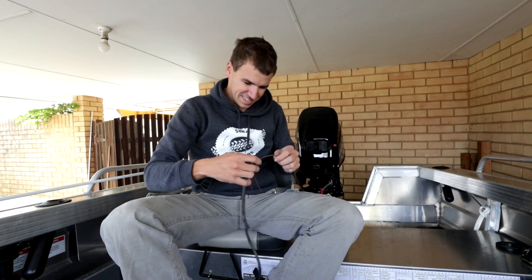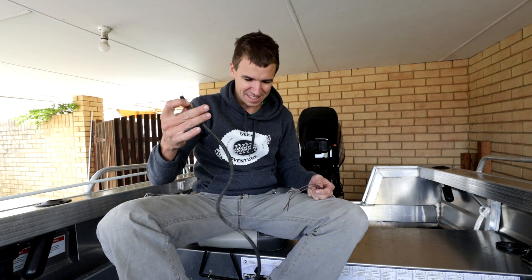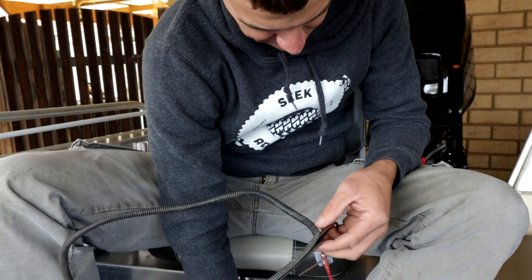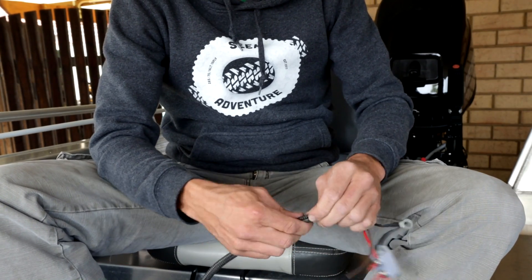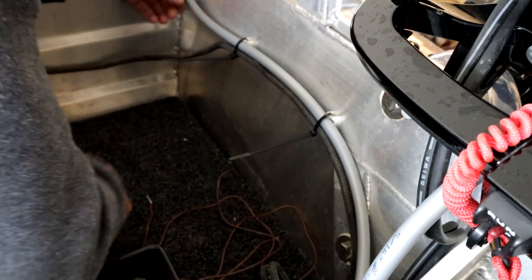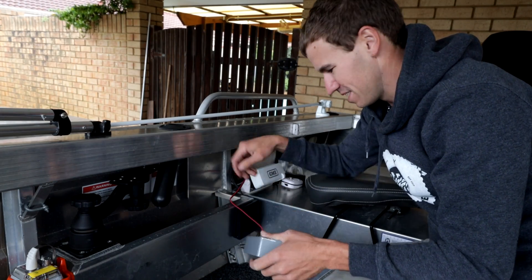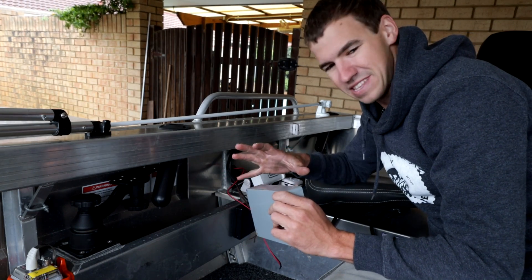We're going to put the main cable going from the battery to the junction box in split tubing, but first I want to attach these two brown cables to the main power cable. These two cables are going to be the power for the bilge pump — one's going to be the automatic cable and the other one's going to be the manual cable from the switch. I'm just going to tape it onto here and put it all through the split tubing so that it's all nice and neat. The next step is to mount the box, but before I do that I'm just going to drill a couple of holes in the top for the cables to go through and then silicon that up once all the cables are in their respective places.